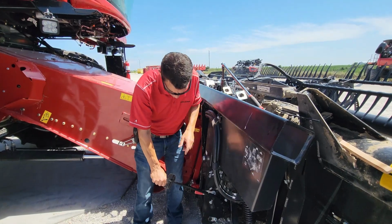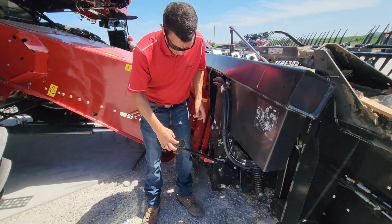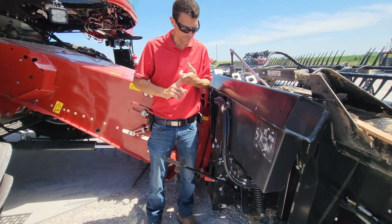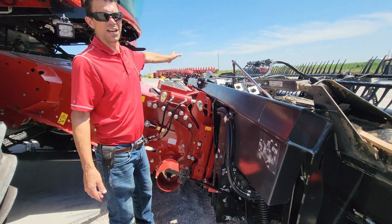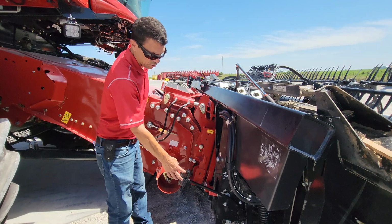So you adjust your float so you get that float to read by pushing this wrench down all the way, so that you're at 2 to 2.5 for that 40 or 45 foot head. So once you get the float set on this side, then you go over to the left hand side and you adjust the float the exact same way over there, get that reading to that 2 to 2.5